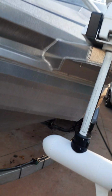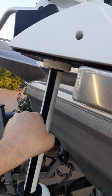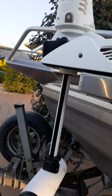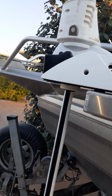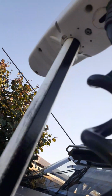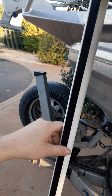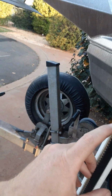Yeah. So yeah, I mean, other than that drama, I had the belt come a bit loose. And as you're trimming up and down, it used to get caught, so I'll just trim that down so I can show you how to adjust it. Alright, so there's this little Allen key. You can tighten this up so you get a fair bit of tension on it. Like, this is as tight as this one will go. But the belt always seems to be a bit on the piss. I think that's why that wears there.